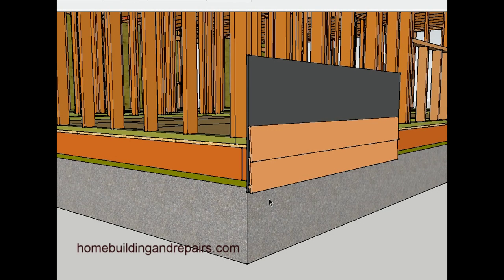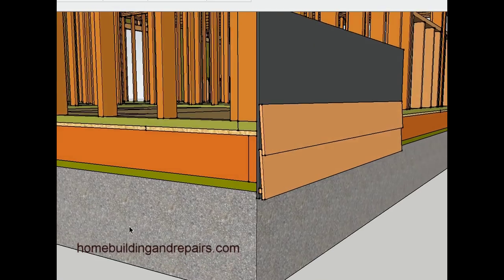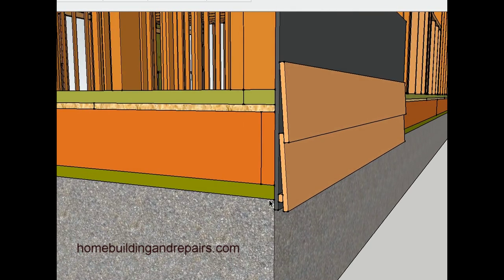Here's what it would look like if you had some siding — I'm using lap siding, but you can imagine plywood siding or other types as well. When I said that it's about an inch below, this is very common. They will nail a starter strip onto the bottom plate, and then they will run the building paper below the foundation line about an inch and the siding about an inch also, depending on what type of building paper you're using.